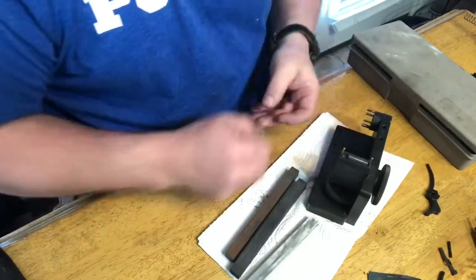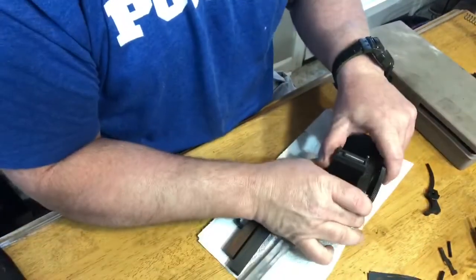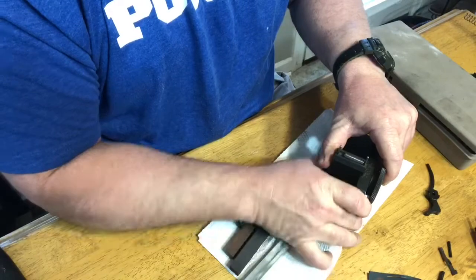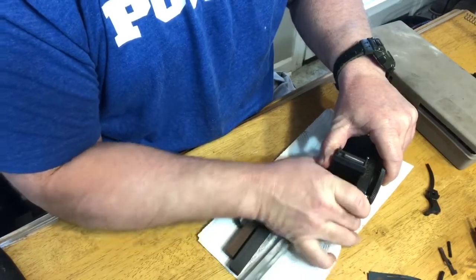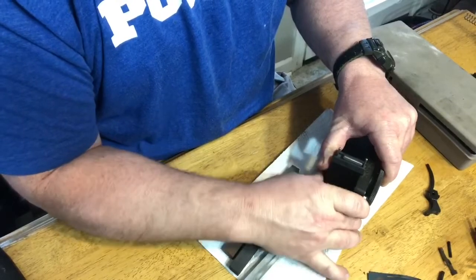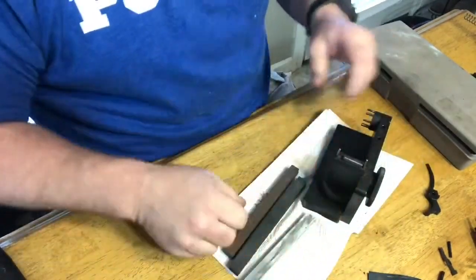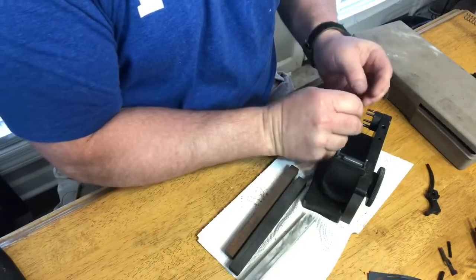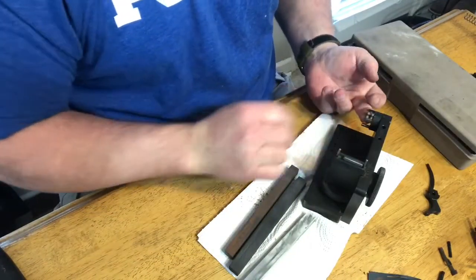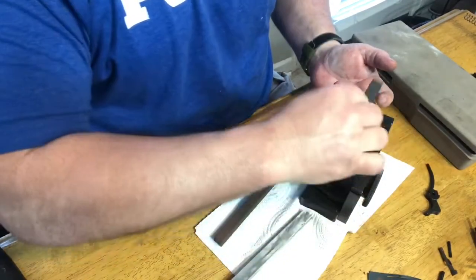All right, now we're gonna run this down 16 clicks to get back to where we were. 1, 2, 3, 4, 5, 6, 7, 8, 9, 10, 11, 12, 13, 14, 15, 16. Now we're at 4 clicks up. We're gonna reinstall our sear into the jig. Make sure it's flat up against the side. We're gonna go to our medium stone.